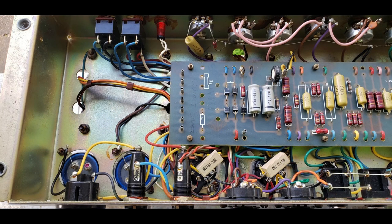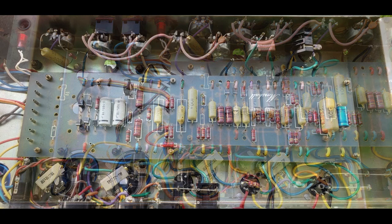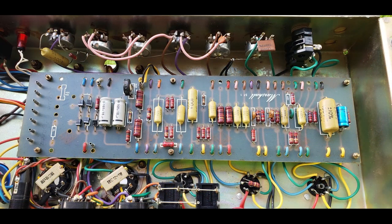Okay, moving on to the power section end of things as the amp came in. Aside from the 1K screen grid resistors on the output tube sockets, everything looks pretty much stock, but we're going to get into a couple of particulars when we get to the detailed photos. And here's an overview of the rest of the amp as it came in. I knew I was going to be replacing the old bias capacitors, and relatively few components needed to change it to cascaded gain and moving a few wires, et cetera. Everything else we wanted to remain stock as much as possible.